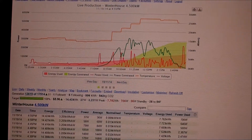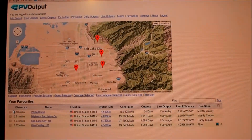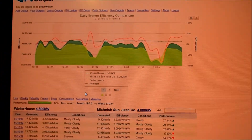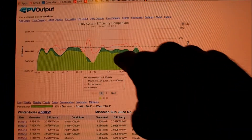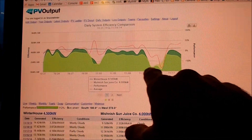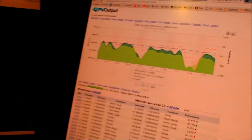You can look at previous days as well. One of the useful things you can do at pvoutput.org is compare your output with nearby neighbors' solar installations. This way you can detect if your system or their system is malfunctioning. Here I picked a nearby neighbor, and you can see this is normalized data, so independent of the size of the installation, those plots should line up. And they do fairly well — you can see when the clouds come in we both go down, and when it's sunny, it looks like I have a slightly more efficient system. Solar power may be coming to a roof near you.